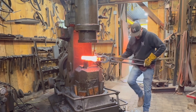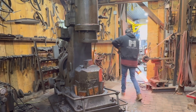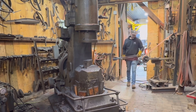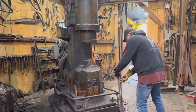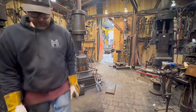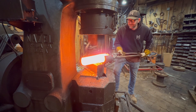The tong ring actually slipped off here, so I had a little bit of trouble on the first heat, but I got a different size tong ring on the next heat and that wasn't an issue. For the first part I'm just eyeballing this. I'm going to have one of my guys help me with a sizing block in a minute. As we break this down to exactly two-inch square, we want to leave it a little heavy for machining, so we cut a block on the bandsaw that is 2.1 inches — just a little bit larger than two inch so we can forge it to 2.1 and then machine off the rest.